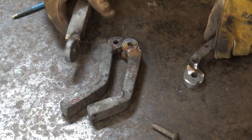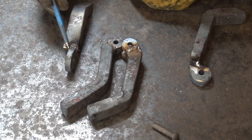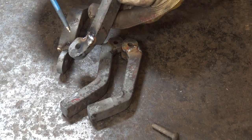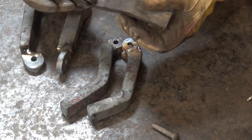While I was over there — remember the ones that we did a twisted end on? I had fullered in here and then given it a 90-degree twist to form the boss, and we didn't actually show this. This was just my first experiment. I wasn't real happy with it because it had a little cold shut at the edges of the twist. So I went ahead and welded, ground down to the bottom of the cold shut, and welded that in. That seemed like an easier way, but I really think this other forged method that we've been concentrating on ended up being just as simple, and it is coming out much better.